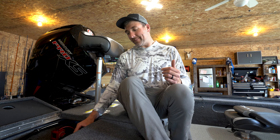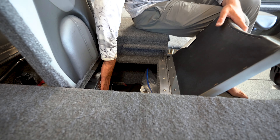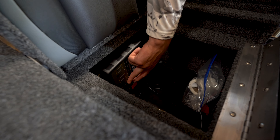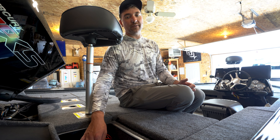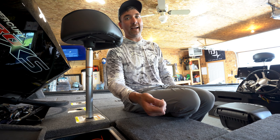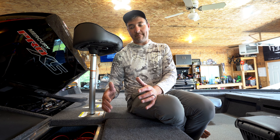The run-and-gun chargers were a little bit more complicated. I had to get RJ from Powerhouse to explain it. In here I've got an onboard charger - this is a Minn Kota 4-bank, though you only need a 3-bank. I'll take three of these banks for a total of 30 amps at 12 volts, run them all to the house battery. Once that house cranking battery goes over 80%, it's going to activate the run-and-gun chargers and my whole system is going to charge just off one plug in the back. Super simple for wiring, really convenient, everything's in one place - it's a really efficient and unique system that people haven't really caught on to yet.